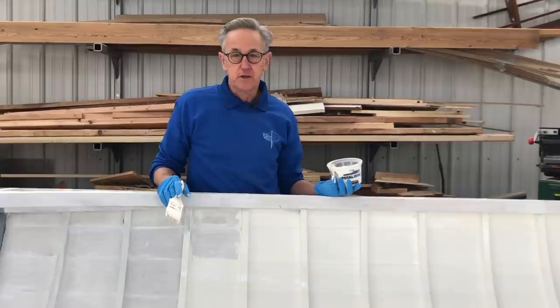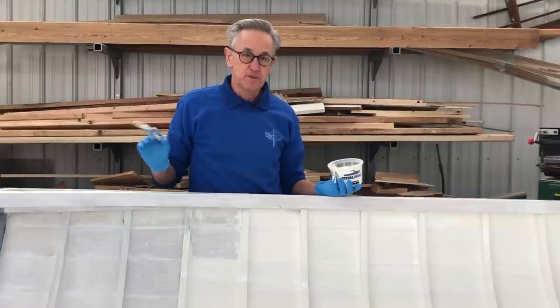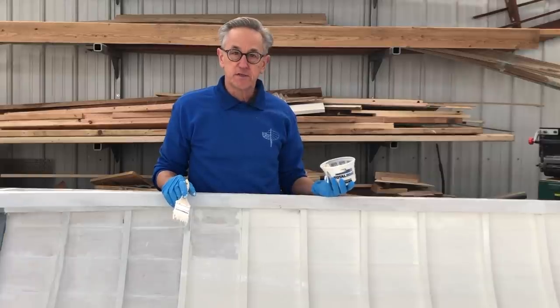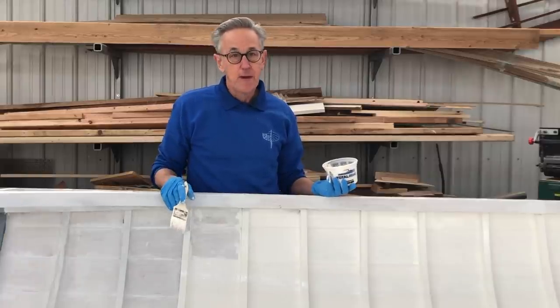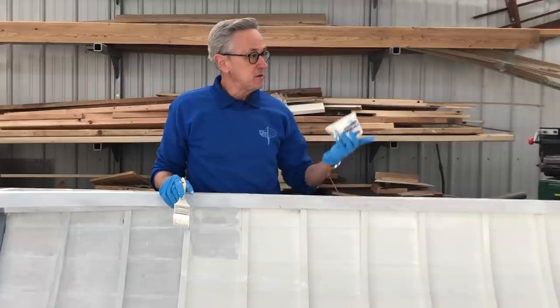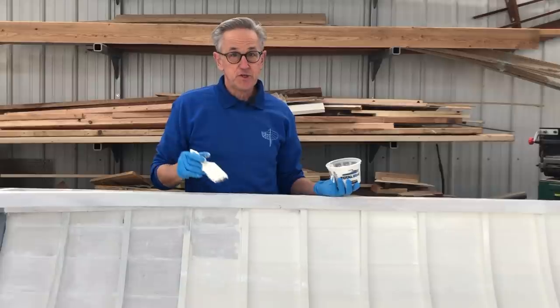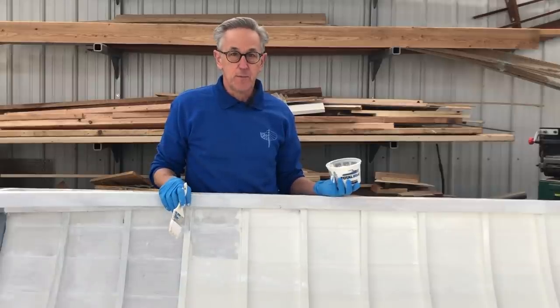to do is to start installing those floor beams and deck beams. In addition to that, I've got a couple of other pieces that I made, including the mast step, and I'm going to be trimming off the back of the transom. In addition, hopefully we'll start to get some bulkheads in. All of that's coming up on this episode of The Art of Boat Building.